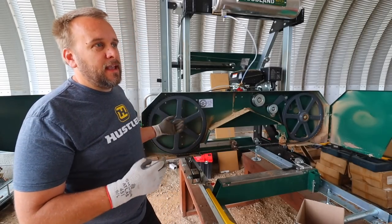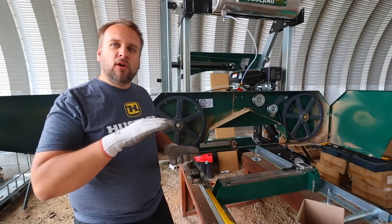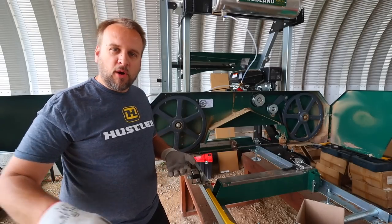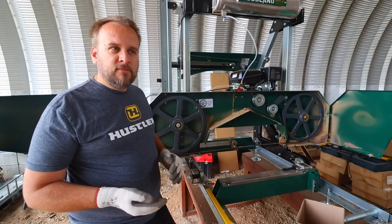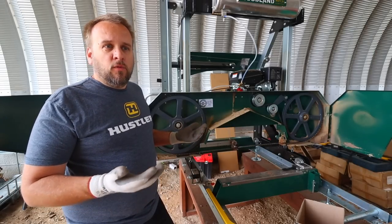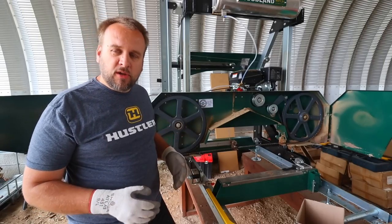And I think I have shortened the life of this blade by being indecisive about where to make my first cut and making multiple unnecessary cuts, sometimes cutting just the bark off of part of the top of the log. But a lot of people on there were saying maybe 3 or 4 hours. And even on top of the other things I've mentioned, it's a big factor what species of log you're dealing with, and what you're using as a lubricant and how much lubricant you're using.